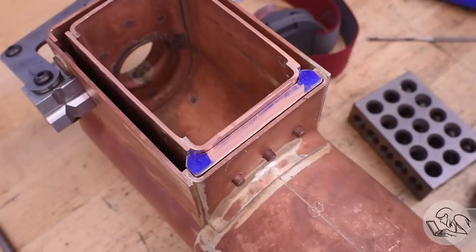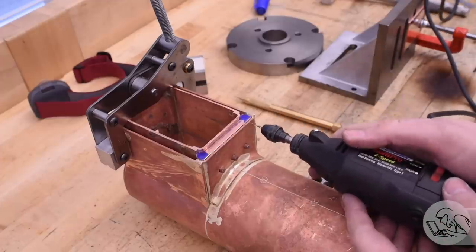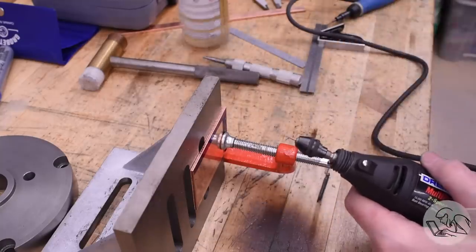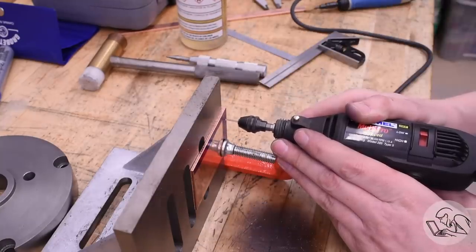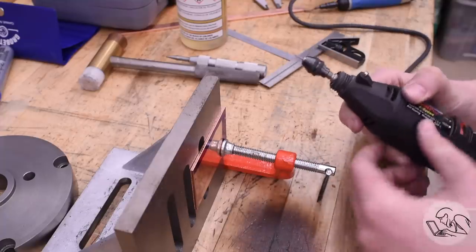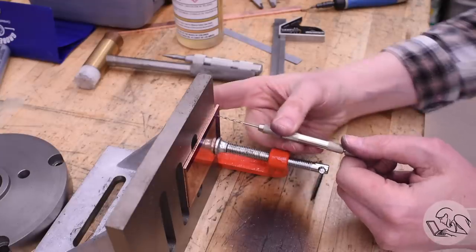Once I'm happy with that fit, I need to drill tiny holes in the front of the throat plate for the fixturing screws required for silver soldering. Unfortunately this will not fit in my mill in this orientation. I thought I might be able to use the Dremel to do this by hand, but I wasn't sure I was going to be able to control that, so I did a test piece just to see — and I'm glad I did, because this is impossible to control. The speed is about right on a Dremel for these tiny bits, but it's just too difficult to hold it steady enough to get a clean hole. The second thing I tried was to put the drill in a pin vise and simply drill this by hand.